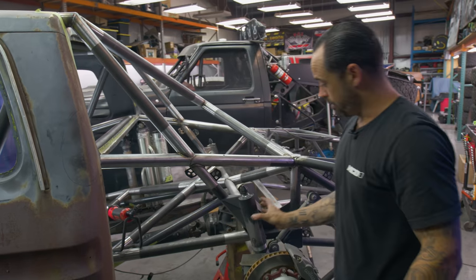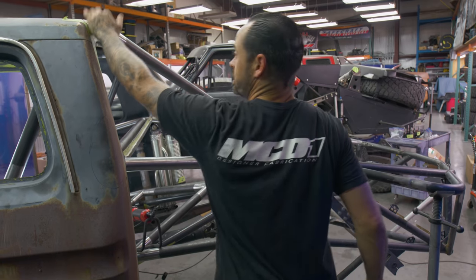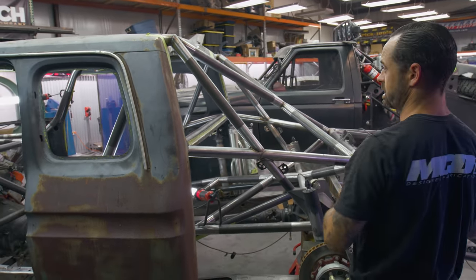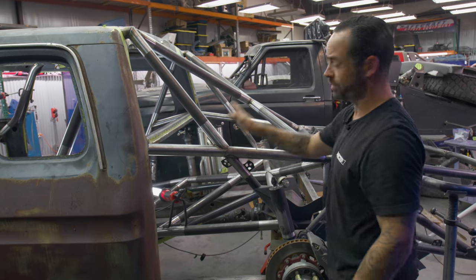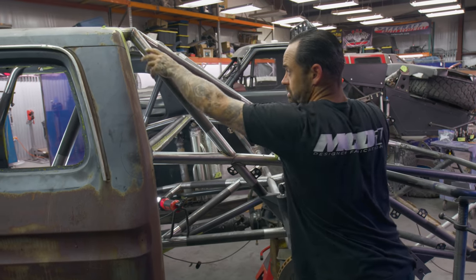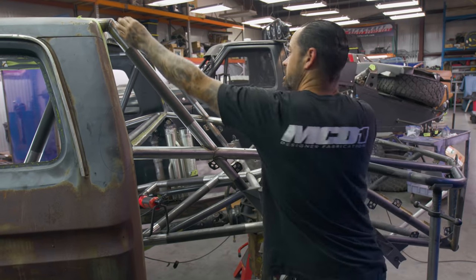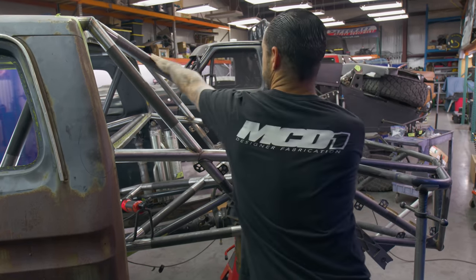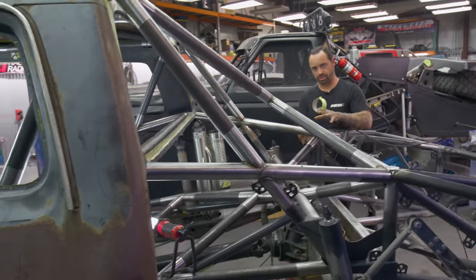With that being said, this is a really integral part of the chassis to tie into. So you get a good tie-in of your whole chassis. The down tubes are important. And it's not just about running them somewhere to look cool, but running them where they make sense. And having this as a multi-plane down tube structure, this primary down tube, there's a partition in here, same thing, miter partition, that we're very strong with around here. This portion goes right into your bump zone. Then it ties into the X, which is a different plane that ties into the rear portion of the chassis.